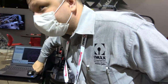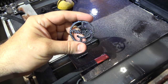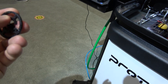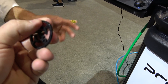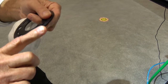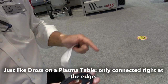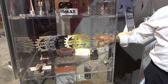What's this steam coming out? That's water vapor. Is it something you'd want to be wearing a respirator for if you're doing it all day? No. And there's no real post-processing required. Are you getting any sort of burr on the back? On softer materials, every now and then there'll be a burr that forms on the other side — but really it's just a bit of material getting rolled over. Technically it's not really a burr; it comes off super easy, like knocking off a wire edge.